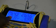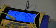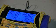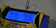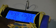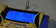To the left here, you've got your indoor wet bulb. You have to pull the temp probe out and then enter your data in manually. Or, if you have a wireless device that has the psychrometer head on it, you can get your indoor wet bulb temperature, connected to a remote, and sync it here with the SMAN4. Once you get everything calculated, it gives you your target superheat. So you can always go back to your original screen and see what your target superheat should be versus what you're actually measuring. The display is very nice, very big. It's not hard to read.